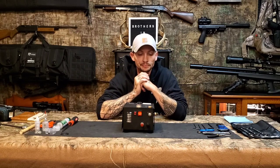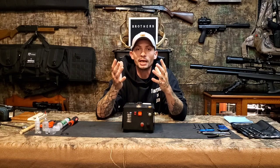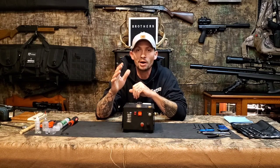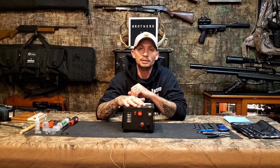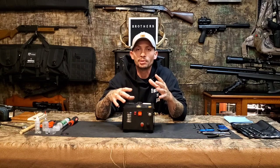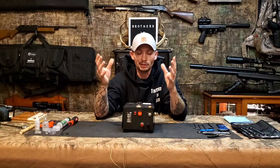I want to give this thing a little routine maintenance, keep it lubricated and running strong. I have quite a bit of experience with both wet and dry pneumatics. Without the routine maintenance I gave it, this thing would not be running like it is after that many fills. When you buy dry compressors, 'oil-free maintenance-free' basically means disposable — they run until they crash, then you toss them.